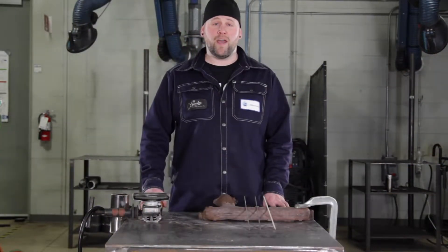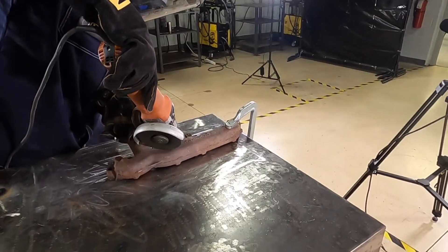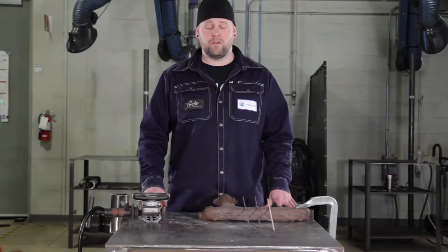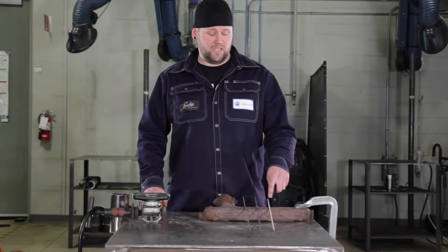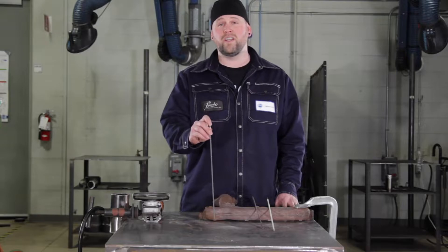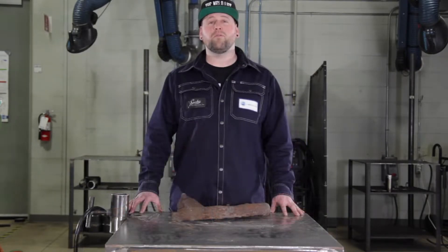When I ground into the manifold, I saw a short dark yellow spark with an orange secondary spark. So when I ground the electrodes, I was looking to match that spark. The barium-free, the high nickel, and the 7018 — which one do you think is the best? If you chose the barium-free steel coated nickel electrode, good job — that's the one I'm going to go with.